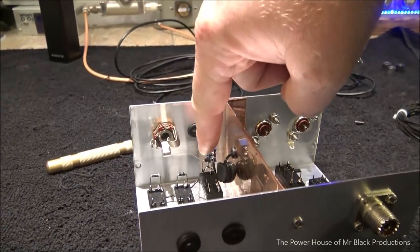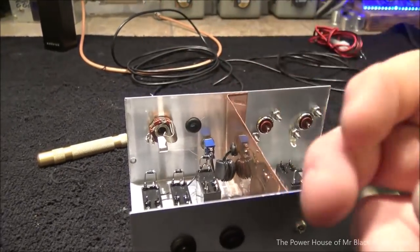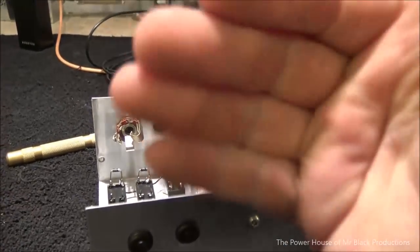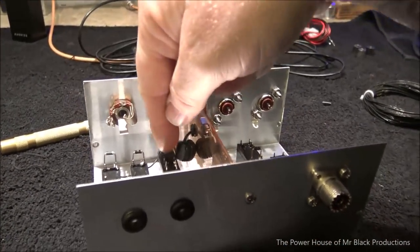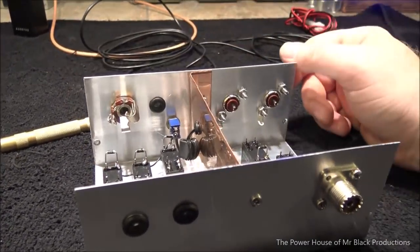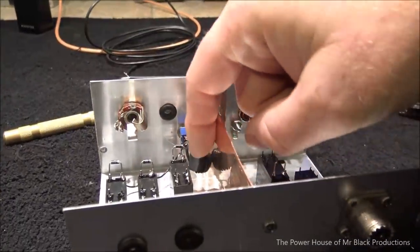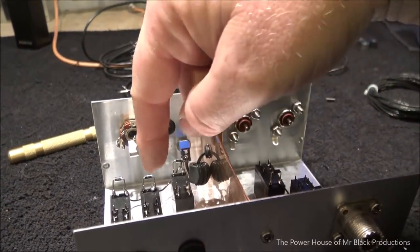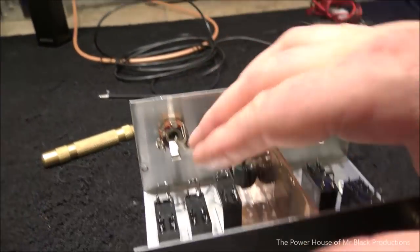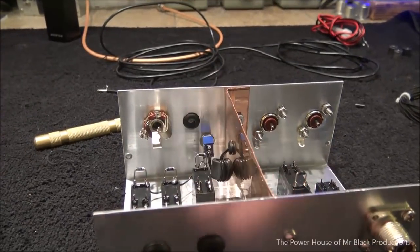So when we do our trigger, the only thing that the trigger is going to do is flip this relay. Then the relay, because it's isolated, the coil is going to move the motion. We're going to use this relay with ground to trip these other relays. So we're going to take a wire and come off ground, which is going to be common ground for the cabinet, to this relay, but then everything from here is going to be isolated. So all we're going to do is be shorting these other terminals together, but we want to do it in a sequence, which is really important.